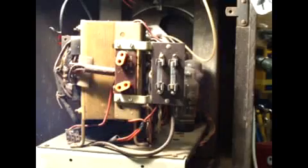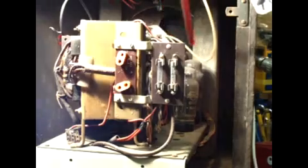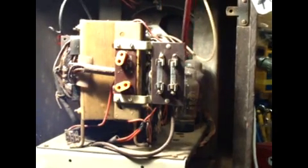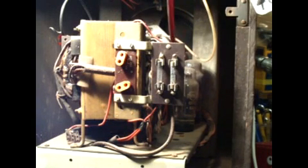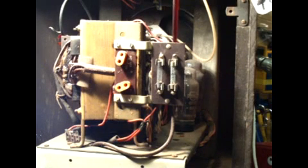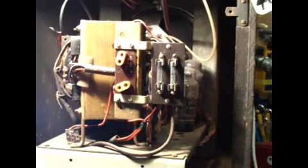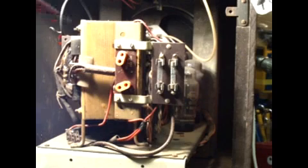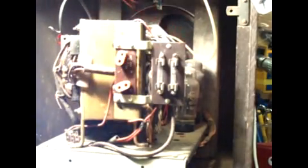Originally you couldn't see the valves behind the actual massive mains transformer. Now we've got a GZ32 here — this is the normal high tension rectifier that rectifies the roundabout 400-odd volts from the mains transformer and supplies the valve anodes. The valve at the back is an EL33, that's the sound output valve for the loudspeaker at the front. Sets of this construction always had the sound output valve on the power supply chassis — that was very common with most makes. The high voltage rectifier, the HVR2, is behind here, and the high voltage smoothing capacitor is here. As I said earlier, the DC supply comes out here.